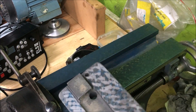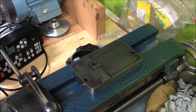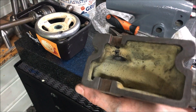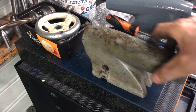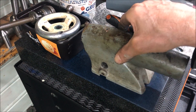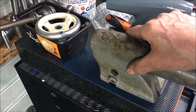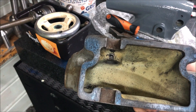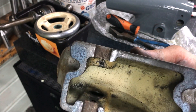And of course, we need to test the top here also, or the underside of the tailstock itself — same way. Because all we are after is 100% contact, or the best contact we can at least. Not too shabby. I just stoned it. It could probably be improved a little bit.